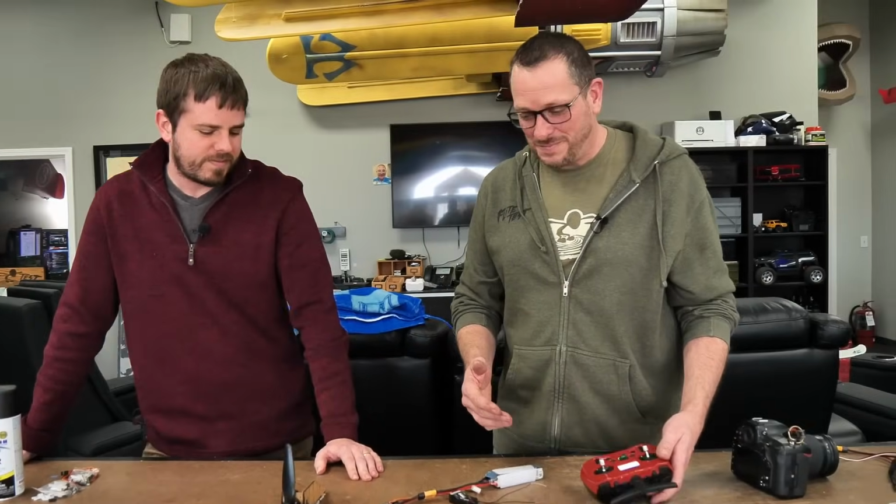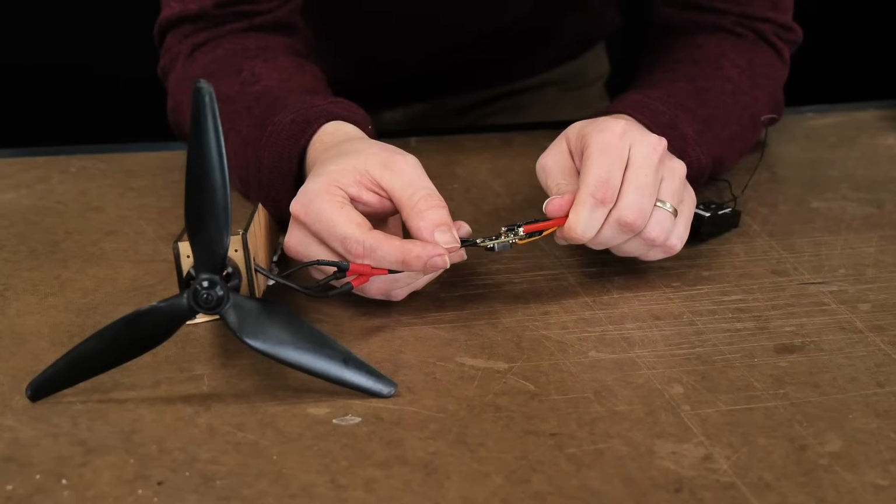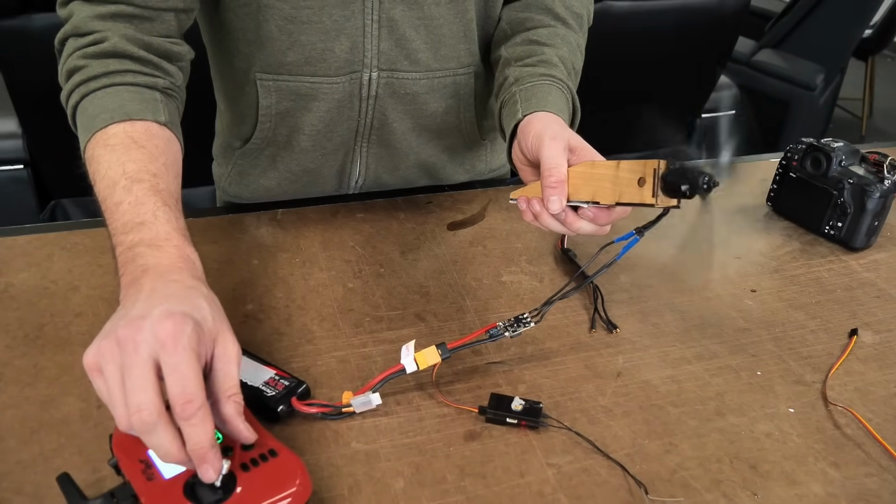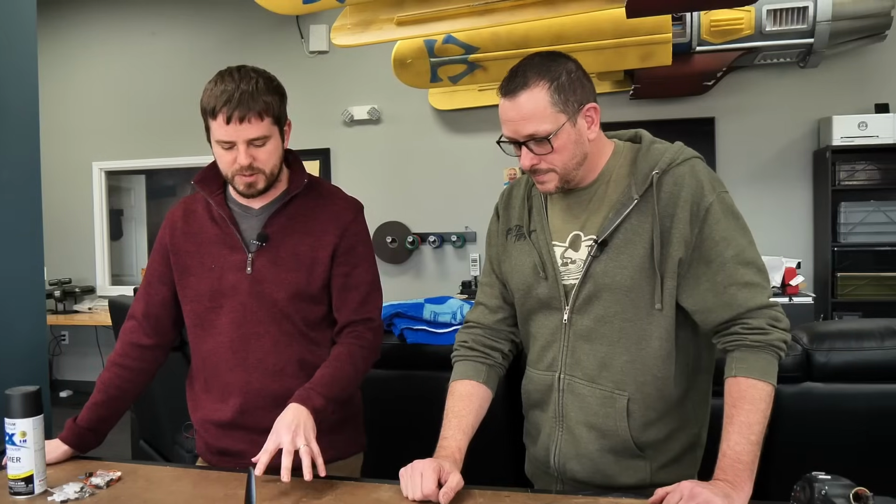That's huge. Typically, if you're flying an airplane and you flip over on a crash, which is a very common thing, and you're at full throttle, the first thing that pops is the ESC, and sometimes that'll even take out your motor. Yeah, so there's a number of things that we really focused on. If we rate an ESC at 25 amps, we're actually using FETs designed for, let's say, 60 amps. Oh, really? And that doesn't mean go dump 60 amps through the ESC, but we're overbuilding it.